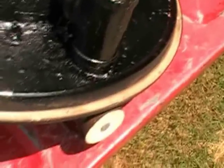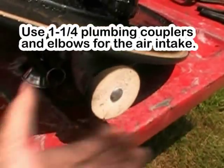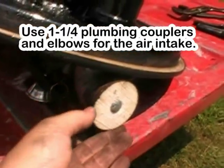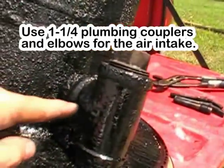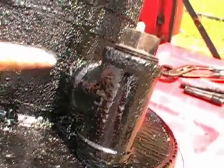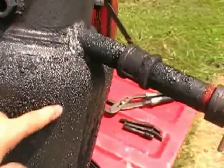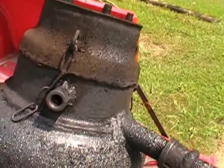Right here is the output of the gas. Now let's look at where the fresh air intakes. This is my on and off valve for the fresh air that controls it. I've got a T-connector here and it's capped off from the side. It goes into the side with another threaded coupler and it's nice and airtight. The pipe comes down and the fresh air is carried to the nozzle right over to the ember bed.